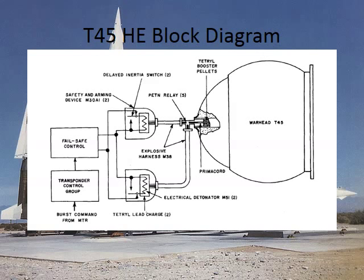This is a basic blast frag warhead. It's brutally simple — there are no moving parts. At the bottom of the rocket motor up under the warhead section is a little opening mail slot door. Every day we would have to open that door, stick our fingers in it while we held the door closed, and hold up two pieces of explosive material that were G-switches. We would have to eyeball them and make sure they were still safe. Now, what did you do if they were armed? We've already got your fingers on it — there's nothing you can do. Those were called M60s and we would have to test them once a month. So once a month you take them out, put them on the end of a four-foot stick, swing the stick around, and if you hear it snap, it armed. You let it stop, let it sit for about three minutes before you let go of it, and you hear it snap again — it safed itself. Then you can stick it back in the weapon.